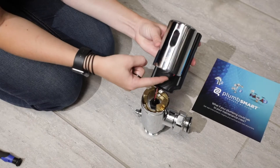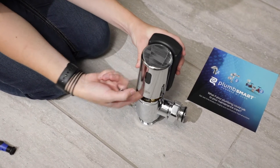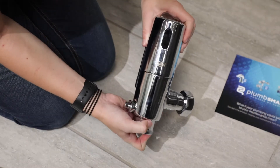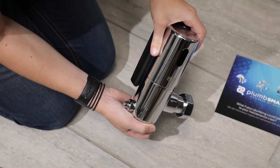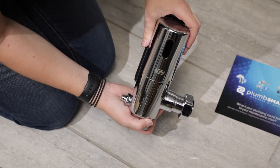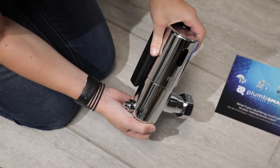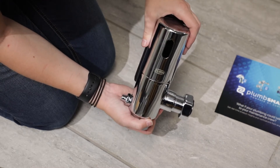You can make use of the space within your sensor cap to store the red and black connectors. Align the sensor cap screw hole with the keyway in the ring insert and place the sensor cap on the valve body. Rotate the cap counterclockwise until the set screw is visible and the sensor itself is facing forward.